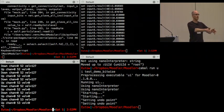There's a DSO in memory that's generating samples. And then as soon as it's finished one batch of 256 and it knows that the next DSO is ready, it's just jumping to the next one. So there is no delay. So you get a clean switchover. In fact, if I was feeling really fancy, I'd interpolate between the two.